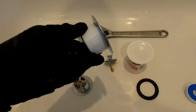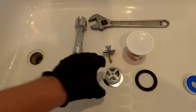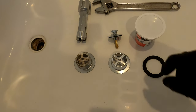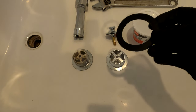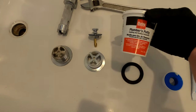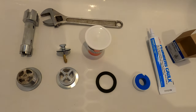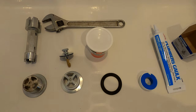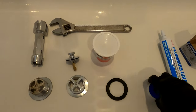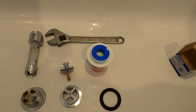So I would suggest the very inexpensive tool. As far as the new one, it is the correct thread type and it's more or less identical to the old one. Now, what you might find when you purchase this is these come with a rubber O-ring, which is fine — that's great. However, the original plumber used plumber's putty, so I'm going to do the same thing. I'm not going to use the rubber gasket; I'll just save it for another project. The plumber's putty and some Teflon tape are really the only things you need.